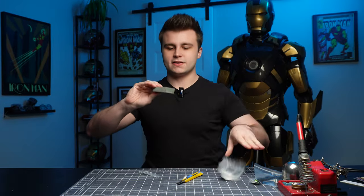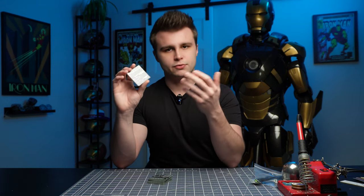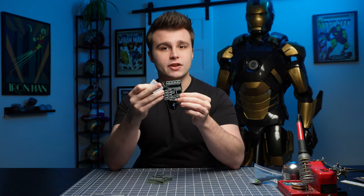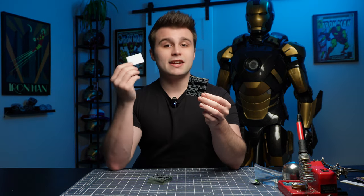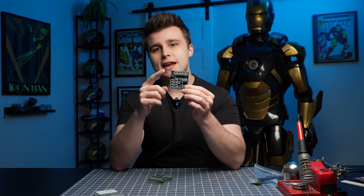These are essentially the 2.0 version of the PCBs I originally designed for the chest motorization, with quite a few improvements and extra features. Instead of using JST PH connectors, which are fairly small, I decided to upgrade to XH connectors, which are slightly bigger — the same connectors used on CrashWorks boards. One change I'm so glad I made is the connector for the power input: instead of a JST PH connector that required wire modification, it's now a USB Micro Type-B connector.